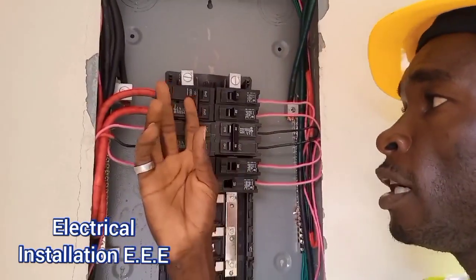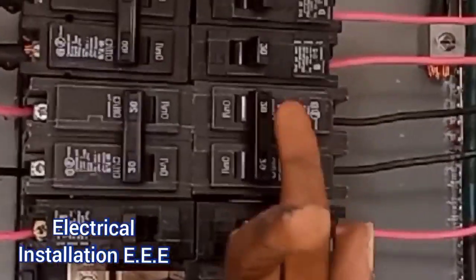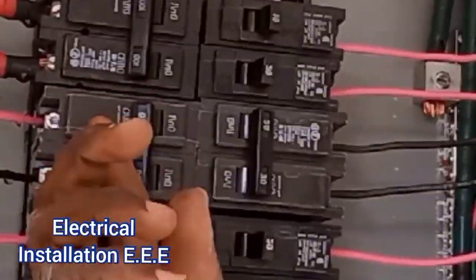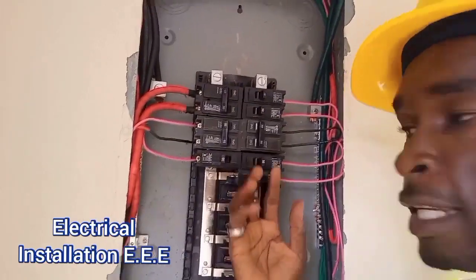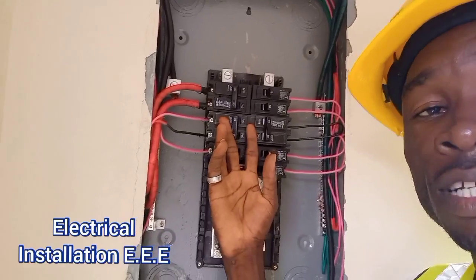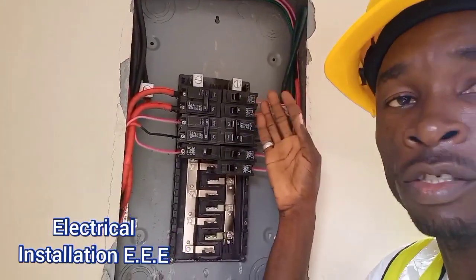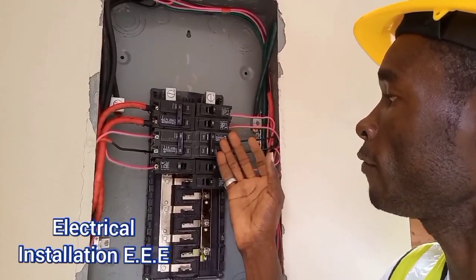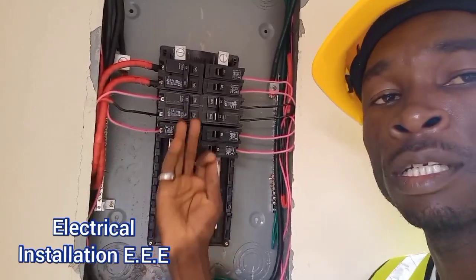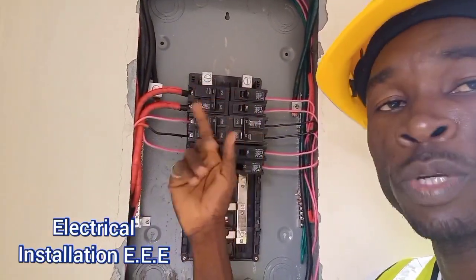If you notice, right here I have my main breaker — it's a double, a 20-amp double. I put doubles across from each other, so I have both doubles across each other. If I have more doubles, I have them across each other as well — instead of all doubles on one side. I like to balance the load, because I don't want most of the load falling on one leg. So we try to balance it as best as possible. Even though diversity factor may play a role, you try to balance your load. We have the 16 here, the SP20 here, and the double here. It's better for the main wires as well with less pressure on one leg.